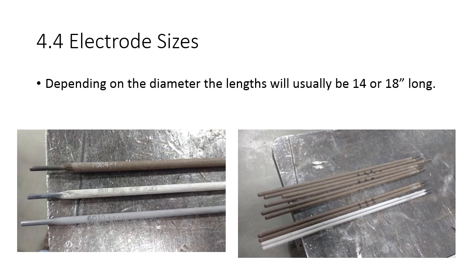But that helps achieve a higher deposition rate when we're welding in a flat position with it, which is the position we utilize it in. So we're looking for deposition rates. It's got a different flux. Then we got 7018 in the middle. But the wire core on all 3 of these wires is 1/8 inch in diameter. So it's just 1/8 inch diameter.